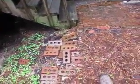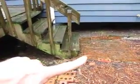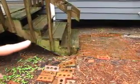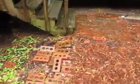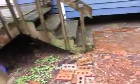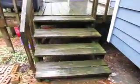So if you can cut that bottom piece right across that line, lay your 2x12 against the deck, cut that piece, or you can measure it out and put a stringer up underneath that in the middle. You can nail it to a 2x4 off of that band edge and bring a piece of stone, or actually, I don't know, it might be able to rest on the front edge of that brick. But there's enough brick out here, you can harvest a block.